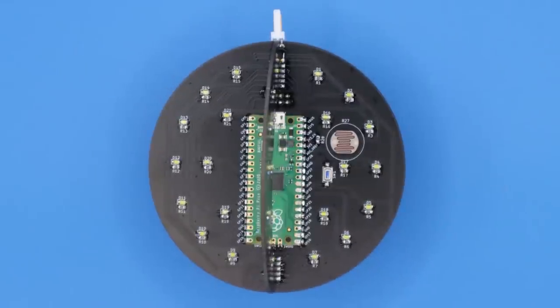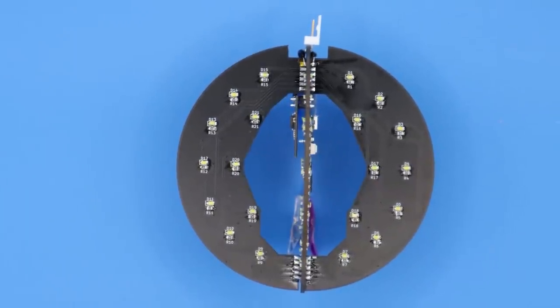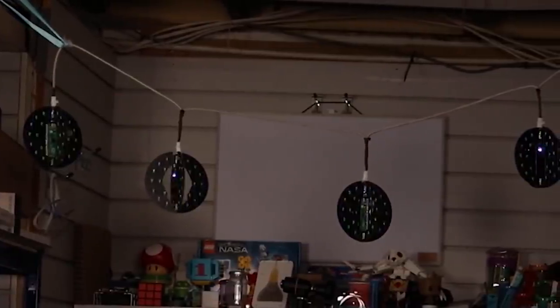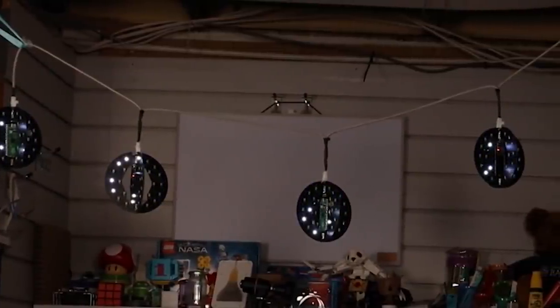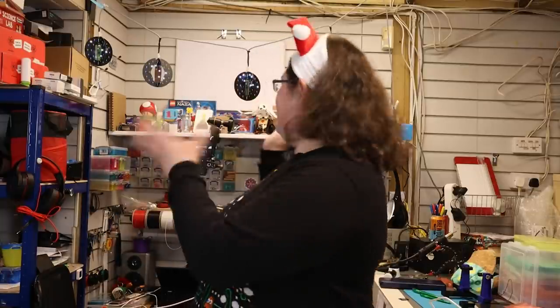Let's take a closer look at them. Now we've seen them working, I'm really pleased with how it's all gone. I'm a bit disappointed I had to make a few modifications to the PCB. I might do a revision two with the added resistors all on the PCB, which I think would finish it off really nicely. I'd also like to get the ESP fully communicating over serial because I could have a lot more control, feedback, and options then. But as it stands I've got some super Christmas bauble lights for my workshop and I'm really pleased with them.